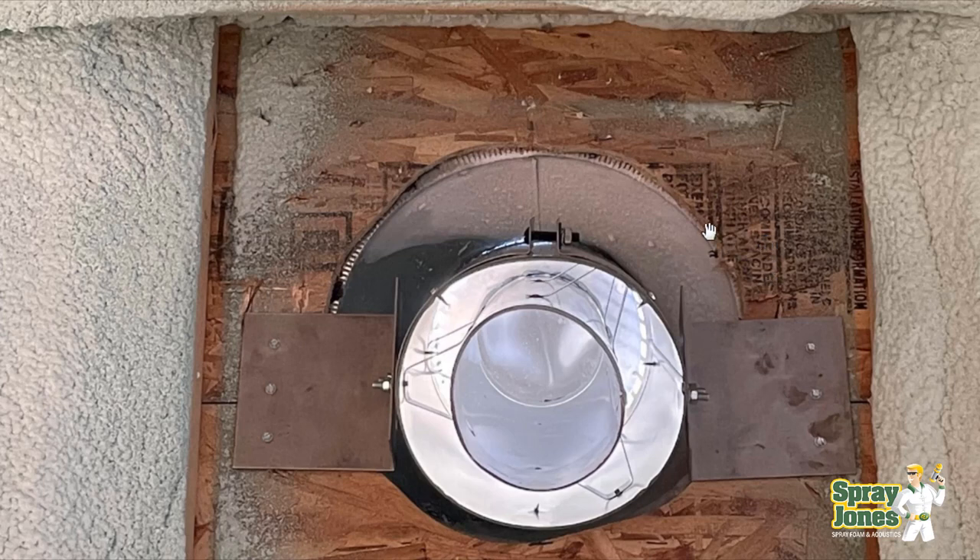Whether it's spray foam or fiberglass, you can't have a two or three inch gap around here — like the generous area we left on a recent house because we didn't know what type of pipe the owner was going to use. If it's a wood fireplace, those usually come with an insulated jacket box; the extremely hot chimney goes through it and the outer jacket is a stop that insulation comes up to and no further. Those ones are clear-cut — warning labels all over them. That's not what we're talking about here.